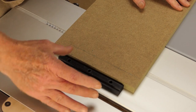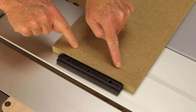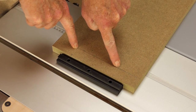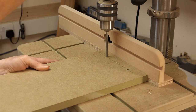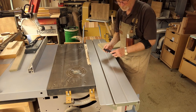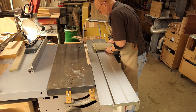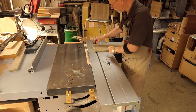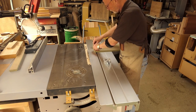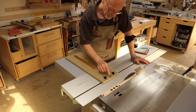The bar drawn is 150-mil long with bolt holes 25-mil in, replicated onto the board to mark the two hole positions. Bolts are threaded through, the T-bar insert is slid in, the baseboard dropped on top, and with some leftover hardware that most people have around, the baseboard is locked in place.